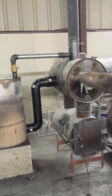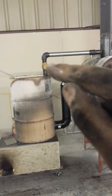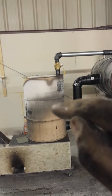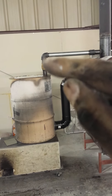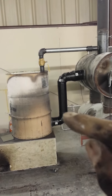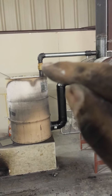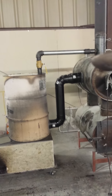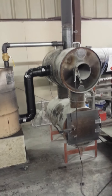Plus the fact that it'll burn everything up in there, and then once it goes through here, it burns it again. So this is going to get hot too — it's a really good test. I put that ball valve in there because when you fire this thing up, you want to have airflow going out of here at the top, at the highest point. Then you'll close that off and open this damper up, and run your exhaust here while that's closed while it's running. This just helps to start it — it gets a better draft going through there.